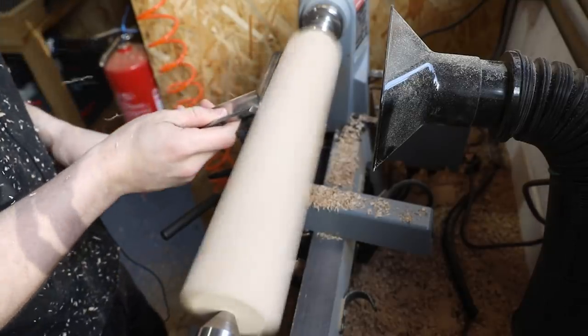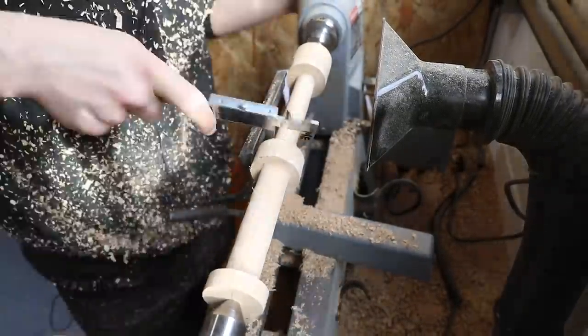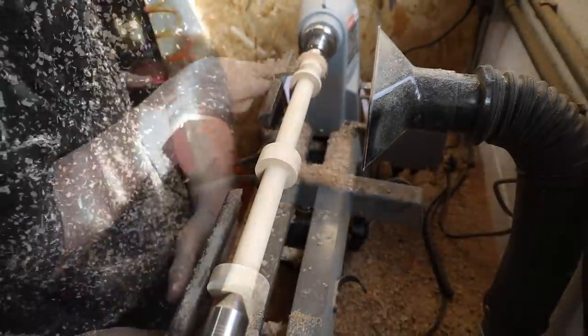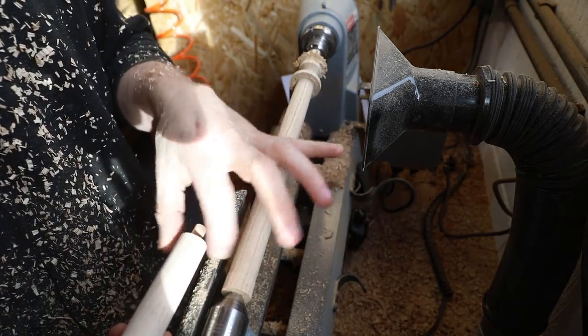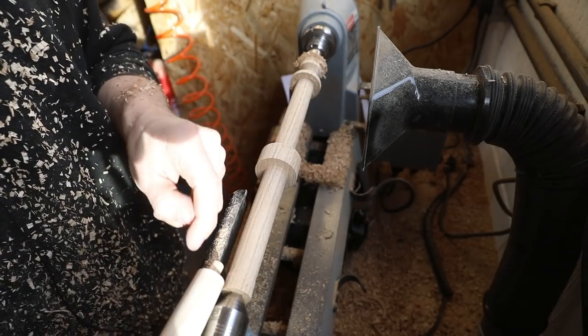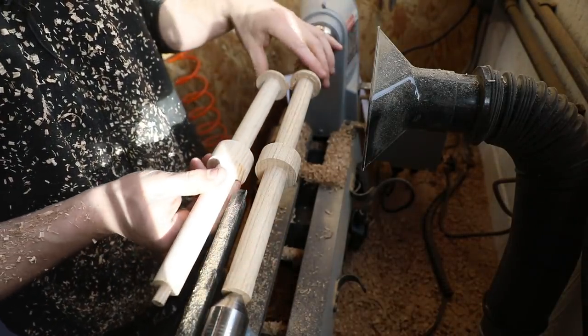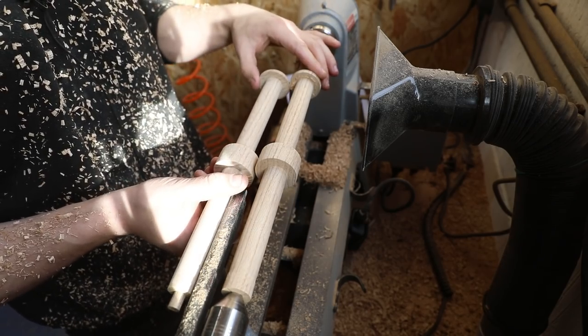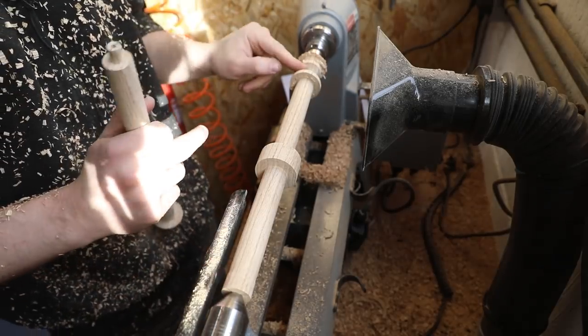Lovely fit. So now this part can go on the lathe, and I just have to make sure I don't put too much pressure on the tailstock because I don't really want to split the entire component. I'm approaching the final finishing of this one — I need to make sure the diameter ends up being exactly the same as this so when I bore the thing that goes around it I can make it a consistent diameter inside. I accidentally made the diameter too small by about a millimetre, which you won't really notice when it's together, but I know it's wrong. I'm going to sand this now and then finish up this bit, part that off, and then see if it slots together.